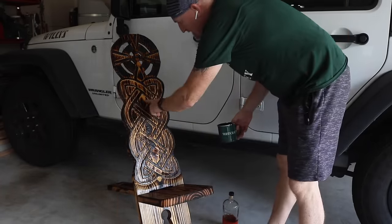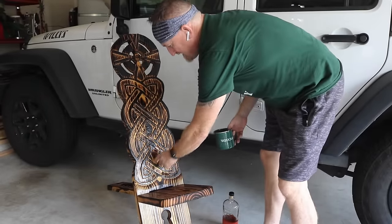The one thing I wasn't happy with was the finish, and that's why I didn't show you the can when I was spraying it on. I went with a Varathane satin oil-based finish for exterior use. I use Varathane a lot — their stains, their finishes — and I have no problem with them generally. But for whatever reason this particular finish took forever to dry, it's shiny in places when it's supposed to be satin, and the texture isn't smooth. So I will not be linking that below. I did take out some weight with the keyhole on the bottom and holes down the leg, but it's still a little heavy. If I had to do it over I'd have probably taken some of those cutouts all the way through. But it works for what it's intended for — sitting quietly and drinking whiskey.